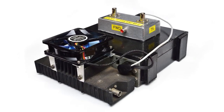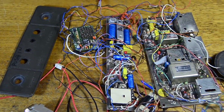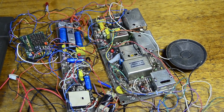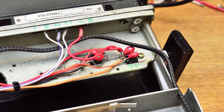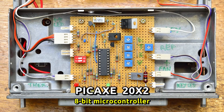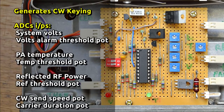The new beacon uses a rugged Philips FM828. To improve reliability, a lot of the internals were removed, leaving only the exciter and PA units. The old power supply board was replaced with modern regulators. A controller board using a 20-pin PicAxe microcontroller was developed by Adam VK4GHZ. This generates the CW and takes care of all the system housekeeping.